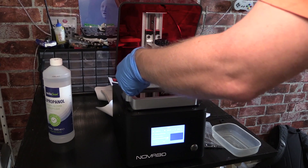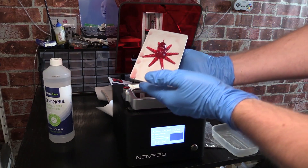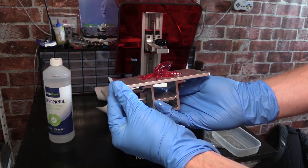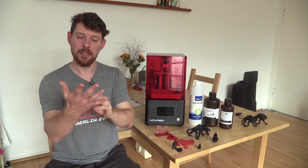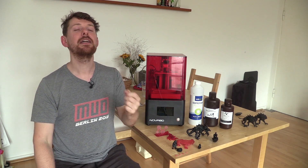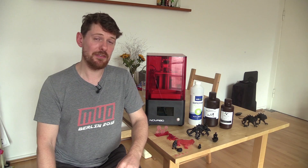The test print is a great primer for getting used to resin printing. You'll pull the build tray out — which is covered in toxic resin — so remember to wear gloves, and you should also be wearing safety goggles, something I neglected the first time. Resin is toxic: it will damage your skin, can give you dermatitis, can hurt your eyes, and even breathing in the fumes can affect your lungs.